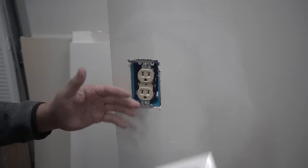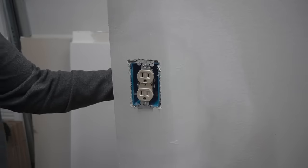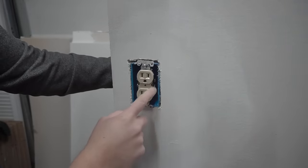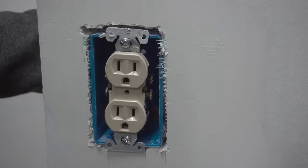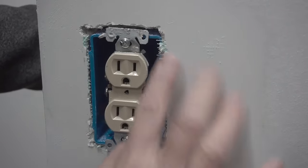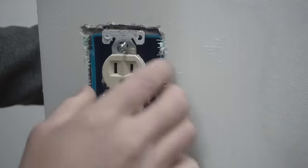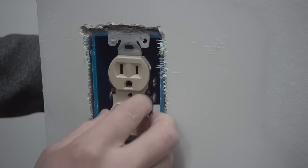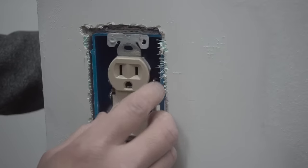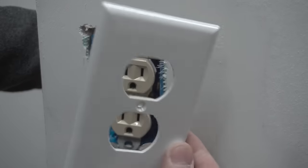This is just a mock-up, but I'm going to explain to you what causes these outlets to sink or to look like they're sunken in from their covers. I don't have this J-Box fully secured. The very first problem that causes these to sink is your J-Box. See how this J-Box — it's supposed to be, when it's installed, right and leveled with your drywall. The box itself, the edge, is supposed to be completely flushed. In a perfect world it will be, but sometimes it's pushed in a little bit. So if this J-Box is pushed in just a tiny bit, once you put this electrical box in, this is going to sink lower from the drywall itself, so when you put this cover in, you will have that sunken look because it's not even with your cover plate.